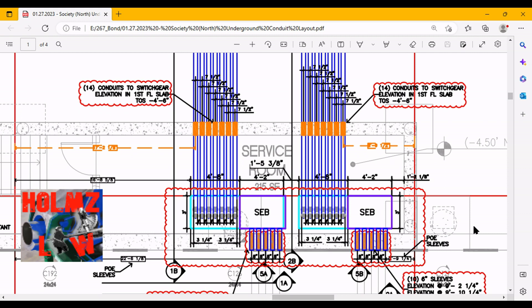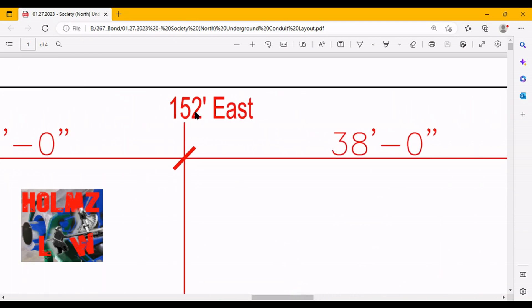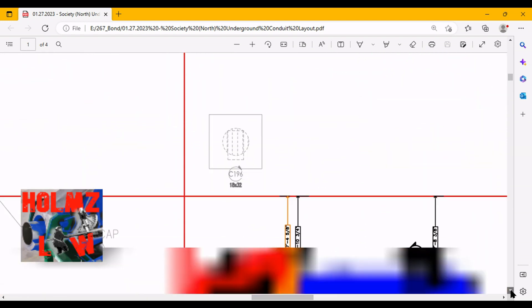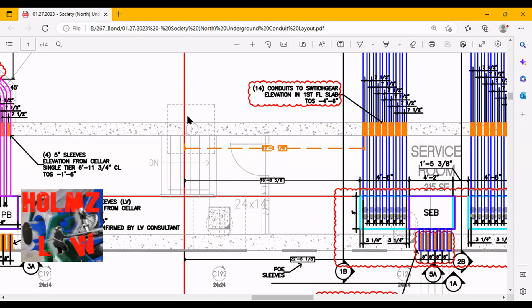Let's say this access line to the left is 152 feet east. If the surveyor doesn't snap that exact line and instead gives you one that's 160 or 150, all you have to do is calculate accordingly — either add or subtract. It doesn't have to be the exact measurement in the drawing, as long as you have some kind of reference point. If it's 152 east and they give you 150, you add a couple of feet; if it's 160, you do the opposite.